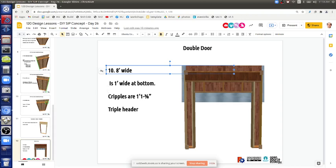I would do it with a circular saw, which is just 1 foot off the edge. Oh, from the outside. Okay. So you put it on the plywood, just cut 1 foot off the edge. That'll be 1 foot. And then for up there, you kind of have to see where it is, mark it, and then cut across it. You'll know when you're cutting into the stud, because it'll be very hard. So it's not a beginner's operation.